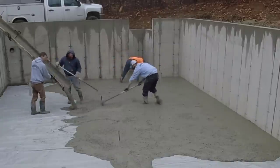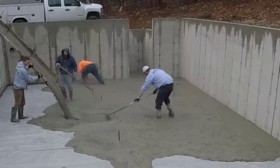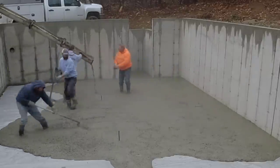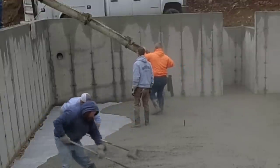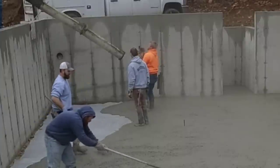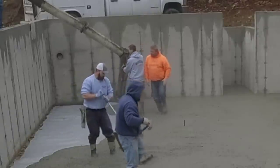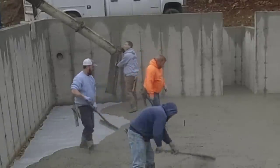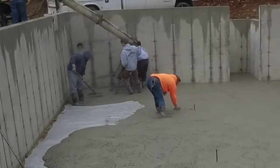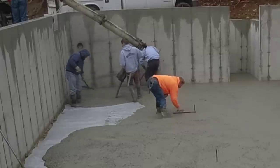So maybe if you're pouring stuff that's very stiff, very dry, however you want to call it, low slump concrete, probably a gas powered one, if you're doing that every day, is going to be a little bit better for you. If you're pouring slumps like we are here, we're using a high range water reducer. We use that in pretty much all our pours, so we can pour a pretty flowable slump. So if you're up around the 5s, the 6s, the 7s for slumps, the battery one's going to be a no-brainer, really.